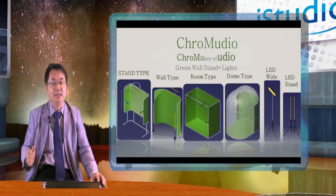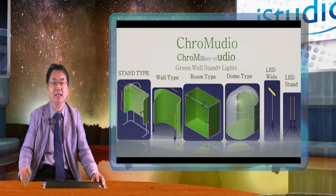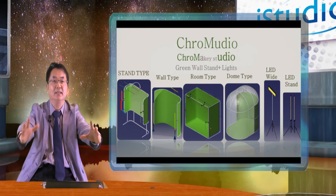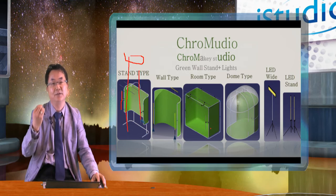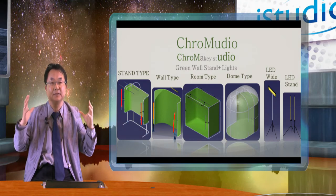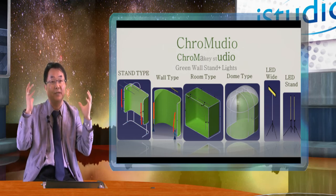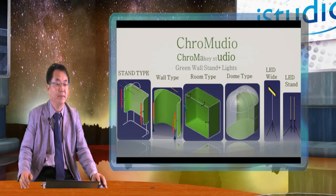We need uniform light to prevent shadow, so we use line LED instead of surface LED. Surface LED has bright light going out so you have to put the light in the ceiling and make the holder bright, but eventually you have a lot of loss. We have a small light here — side two lights. All the time we have two lights. It makes a perfect green background. You don't need a very big light for the background; you need a good light for the actor. The background side is covered by our LED.